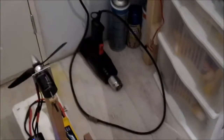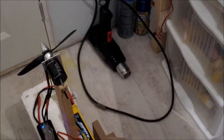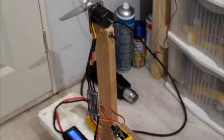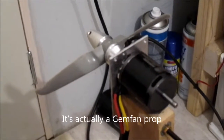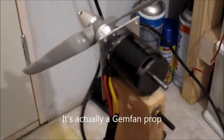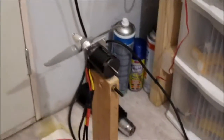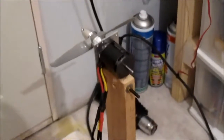Right, now do I try another prop? I've got one more prop here which would be good to try, because it would be good for speed. I'll stick that one on and come back. Alright, so this next prop I've stuck on is one of those aero-style high-speed props - 5.5 by 5.5. I've found them to actually be a pretty good prop for high speed. Interesting to see what we get on thrust.